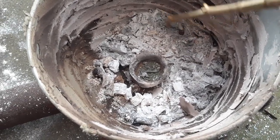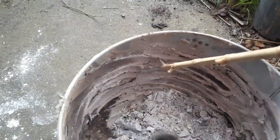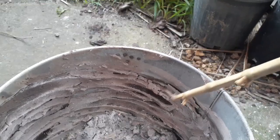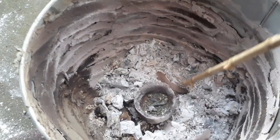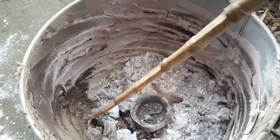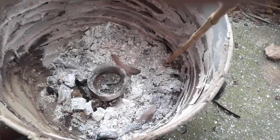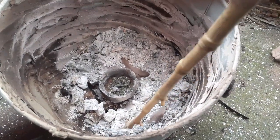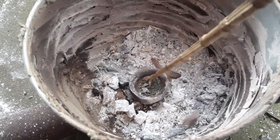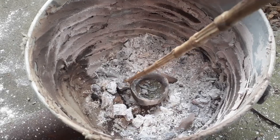Most of the coals are here - some still haven't burnt but it's still a little hot. You can see the edge area has kind of turned to ash - I can tear that off. So the earthen material I used is a failure, but it did work - I could probably use it for another two or three times. You can also see that it didn't melt the metal, which is a shame. I think the crucible cup I used was too thick.